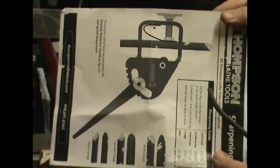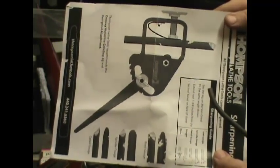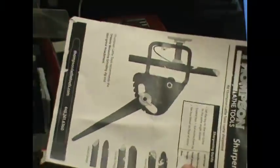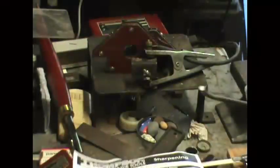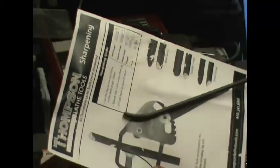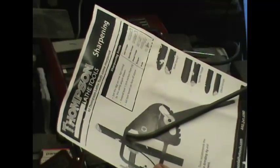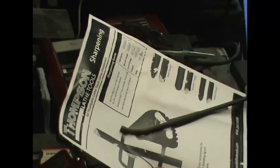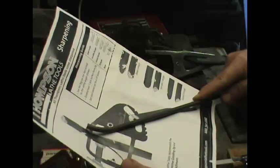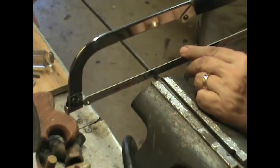Here's the plan I'm working from. This is a photocopy of what the one-way Wolverine jig looks like, and I have to make this leg here. So I'm going to place my rod as it would appear on here, because my rod is actually going to come up right about like that. I'm going to cut it right about here. I have my rod in the vise and I have my hex on here, so I'll just cut it right there.